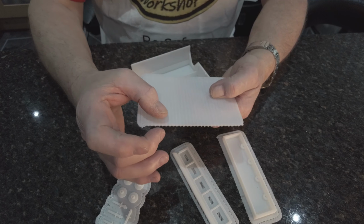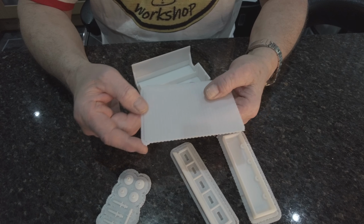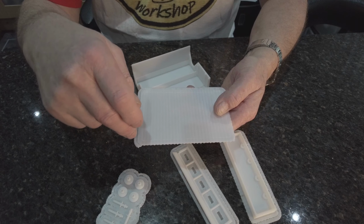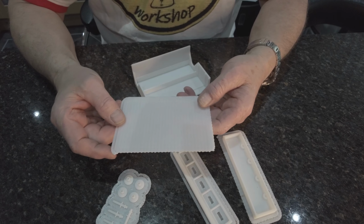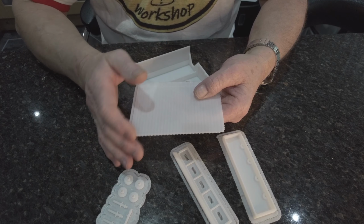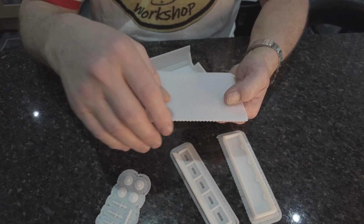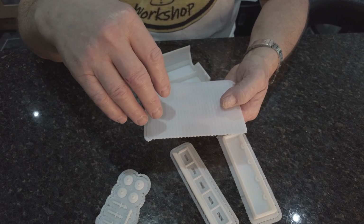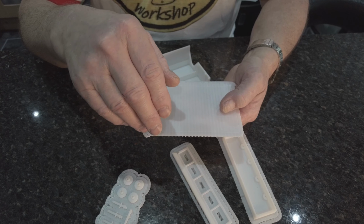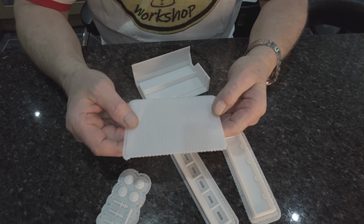When I was scraping, there are 5 metal squares, one in the centre and one on each corner. On the centre one, where the nozzle touches each time before it goes across to the front corner, which is this one, I'd actually caught the metal surface and lifted it. It must make contact with the metal surface somehow. I don't know exactly how it works, and I'm not particularly interested, it just works. But there was a hole right where the nozzle touches off, and you couldn't alter that. I thought, what if I turn it round? Well, you can't. So I had to replace the bed.